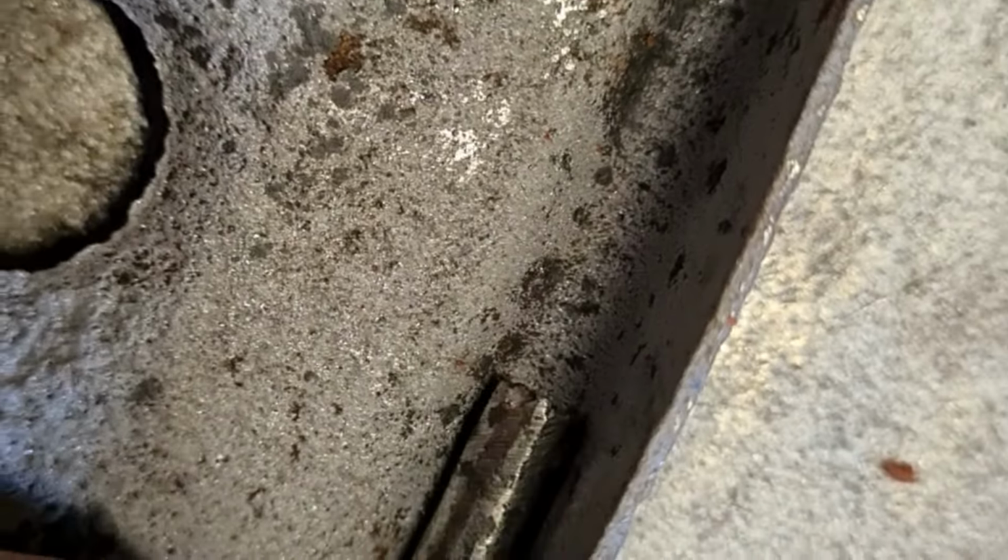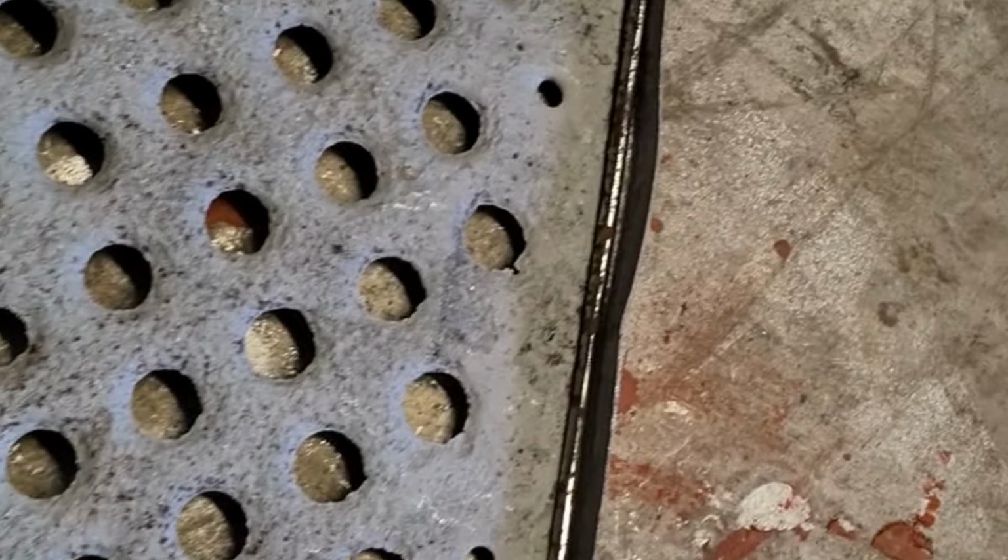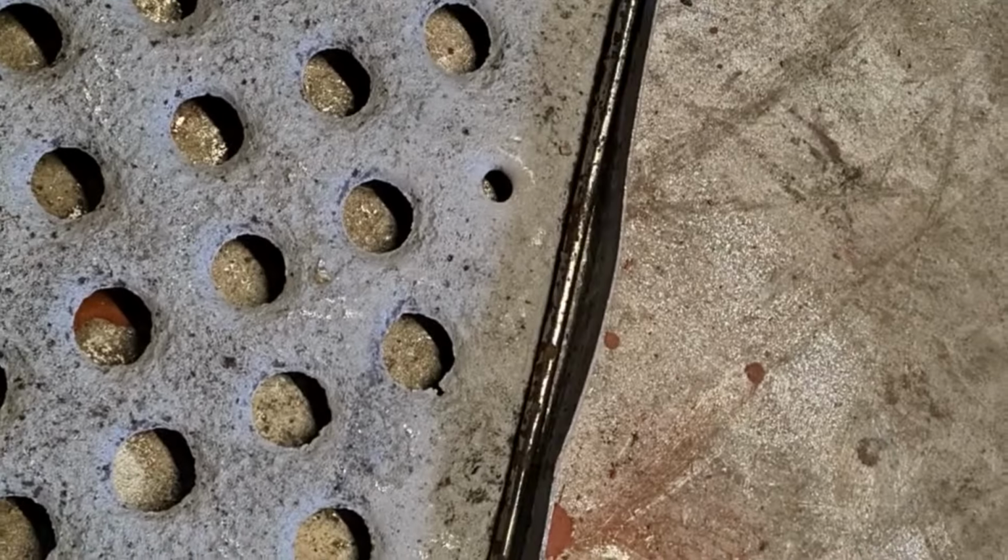Right, so on that little rolled edge, she's split, as you can see. Now, very tender. So the idea is, I'm going to drop the little bit of round rod in there. But it just nicely sits down in that groove, look. It just sits in that groove. And then I've got so much to weld onto from the other side, which will soak up some of the heat and not burn away the tender tin. So we'll have a go at that, see if that will repair that. And that'd be another little job done.